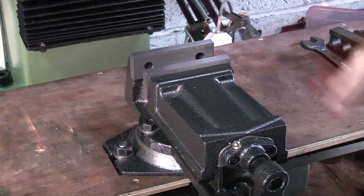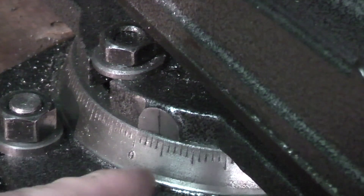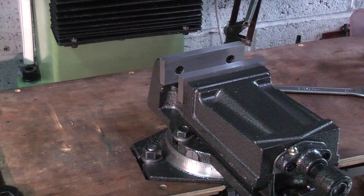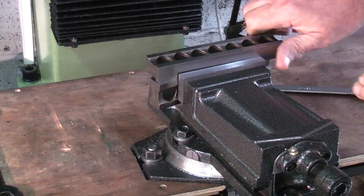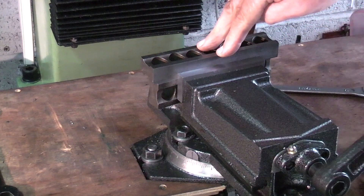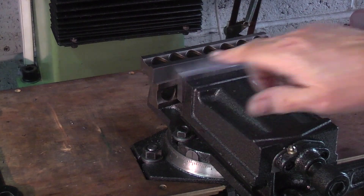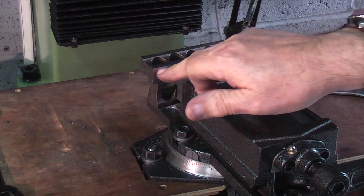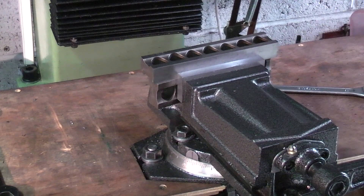So let's suppose we want to set the angle of the vise to eight degrees. I'm not sure how accurate this vise is, so that's eight degrees by eye. The next thing I'll do is use some parallel strips in the vise. The reason why I'm doing that is because I've just now extended the width of the vise jaws to about six inches — I can travel further along the face to get the angle set, because the longer the distance that you have the more accurate you can get the angle set.